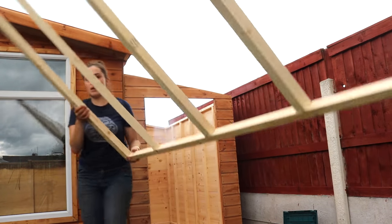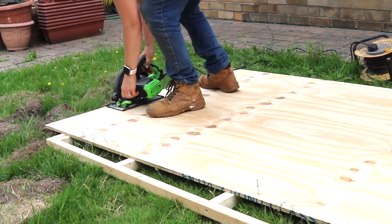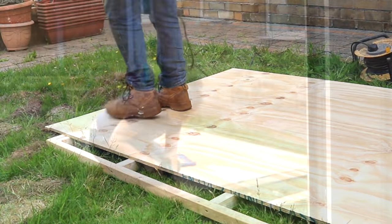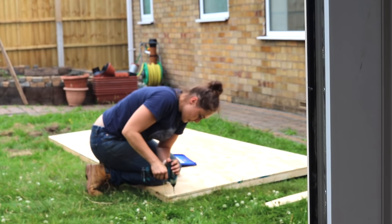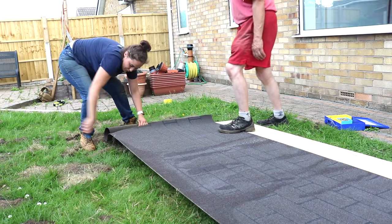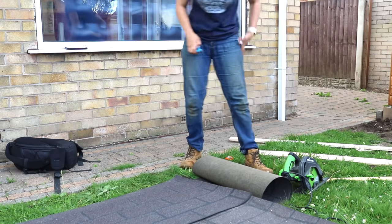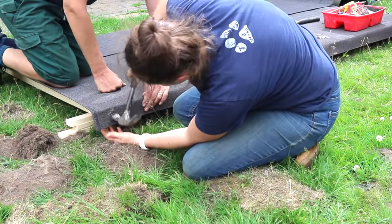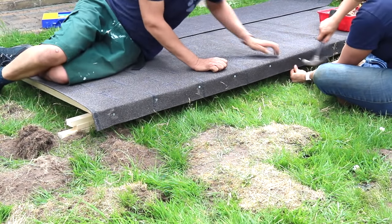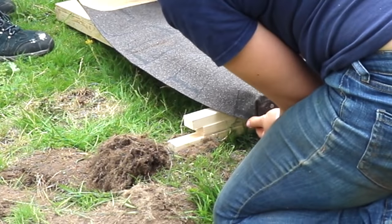For cladding the roof, I trimmed down a sheet of plywood with a circular saw and screwed it down to the spars. Next was to add the roof felt, which I rolled out and sliced two lengths leaving an overhang. I clout-nailed along one edge all the way around — that's the lowest part of the slope. For the corners, I tucked and folded them around and added more clout nails.